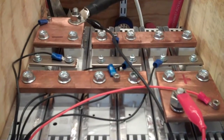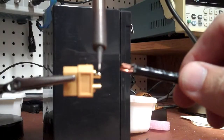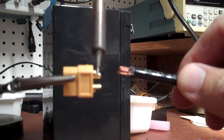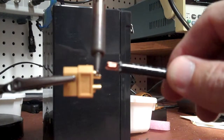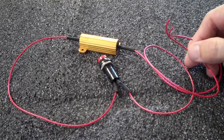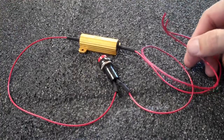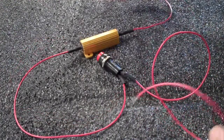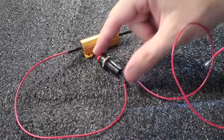This set of wires is useful for this type of charger, and it could also be used for just a BMS that monitors the batteries as well. I'm using this XT60 connector for my charging input. Soldering it to 8-gauge wire really needs a larger soldering iron than I'm using here. This is a pre-charge circuit — all it is is some wire and a circuit that goes through a resistor and a switch.